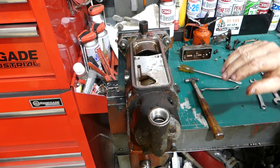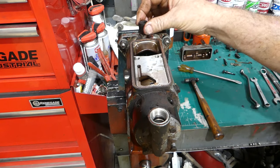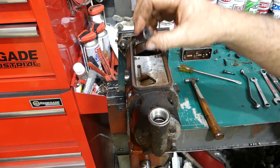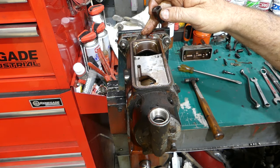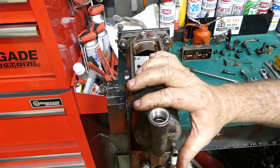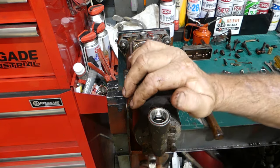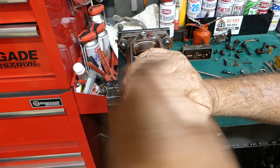This is just a case drain — a 5/8 spanner fits that — that's the return line. It goes back from your pump; any extra pressure goes back through and often hooks up to the top of your injectors, ending up back in the fuel tank or the top of the filter housing. This little fella here is your vane pump — it gets a bit involved with the little shuttle in here.